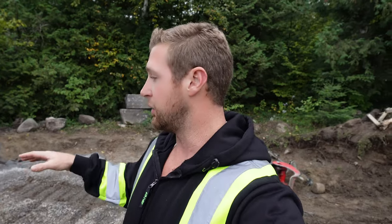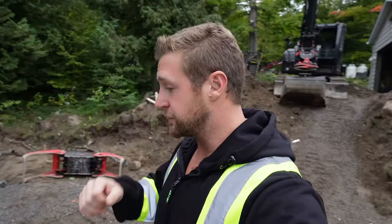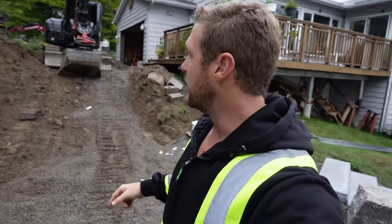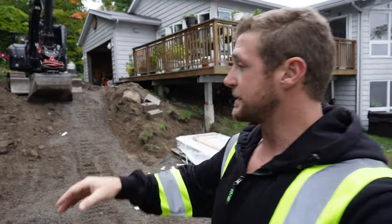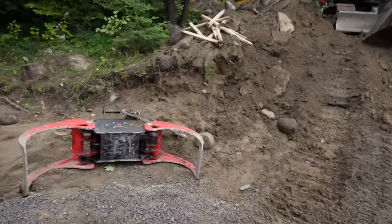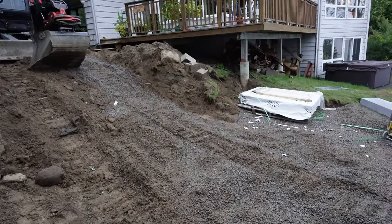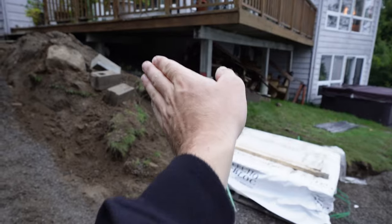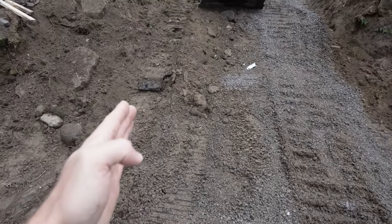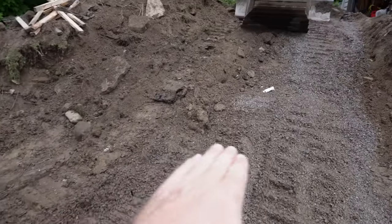After the Gator Base is in, we'll build the fire pit, then start laying the blocks around there, finish off that waterfall. And then, possibly today, if we have time, we'll be taking the 10 ton there and finish excavating out where the armor stone's going. Basically, the armor stone will be going along here. So there'll be a row of it going along here. It's approximately 6 to 8 feet high. And then it'll curl up the side a little bit there. It'll go in here and in here, because the same steps that you see here, we're going to build those steps right here in between the armor stone.